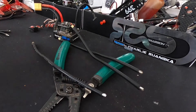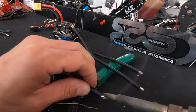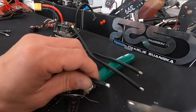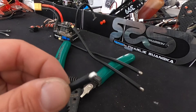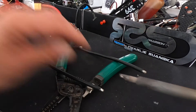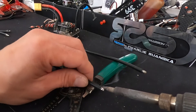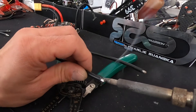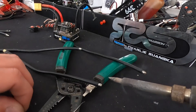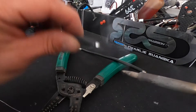I take each of the wires and hit them one more time from another direction, rolling the wire so that gravity keeps a little ball at the bottom. You get just enough solder to tin the edge of the wire — it's not globbed on there. You can see the strands of wire. I hit it from the other side and slowly twist, trying to twist the same way I twisted when I pulled the insulation off, so I don't untwist what I just twisted and get solder in between the strands.